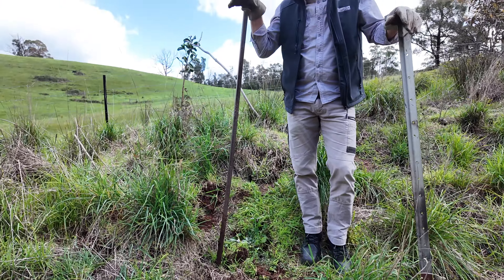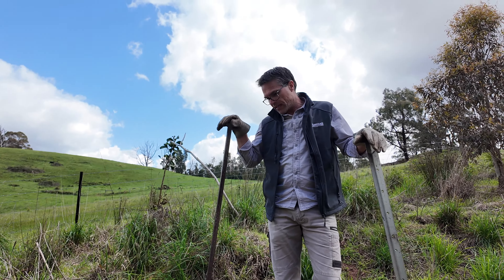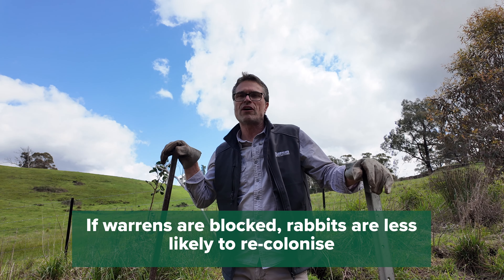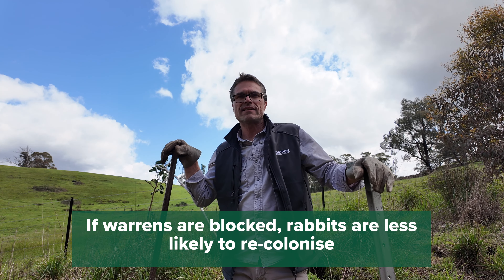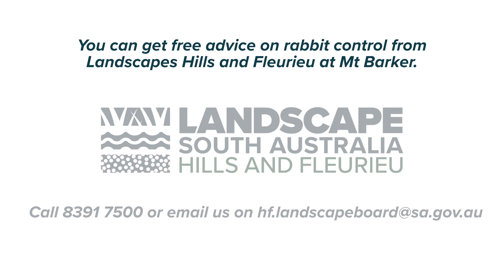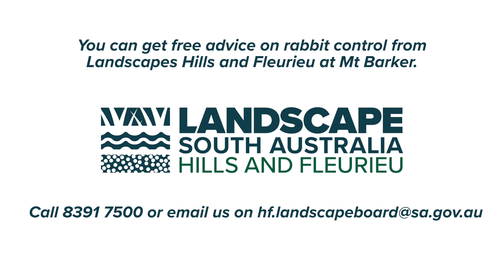It's just a matter of loosening up the ground, and you may need to use a shovel or even a mattock or a pick to spend some time just opening up the hole. Once you've got it opened up, you can get some larger rocks and place them in there and then compact the area down again. If this was on my property, I'd probably have a mattock, a crowbar, and maybe a shovel as well, so I could dig these out a bit more, then get some rocks and compact them down, maybe using the end of the crowbar to compact things down again.